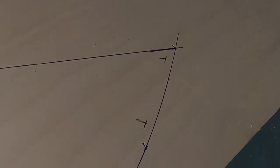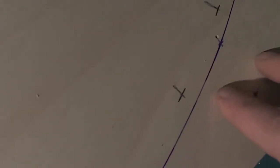Here you can see the drawings — the lines on the plywood. Here we got the arc drawn according to the drawing, and you can see the holes that I used with the nails to make the arc with a metal strip. So you bend the line with an arc every meter. I've got a metal strip of one meter, so you can draw a proper arc to cut out. So let's get to work and cut out the panels.